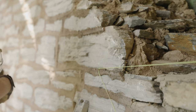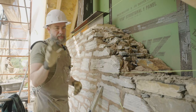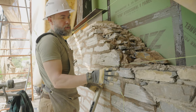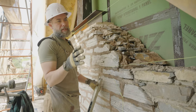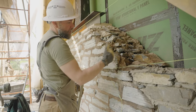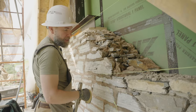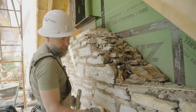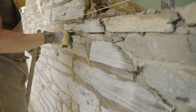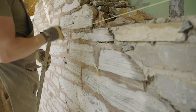Even the stone that we're setting right now has a little bit more darkness to it, but if we give it 15, 20, 25 years it will really start to blend in well. The most important part is trying to find stone that matches and is the same type of stone. Looking at the wall, you see the face stone, the rubble fill on the inside. When these stones are set we also use pinning stones — these tiny little stones right here — so each stone would have had small pinning stones put in. They're covered with cement mortar right now so you can't see them.